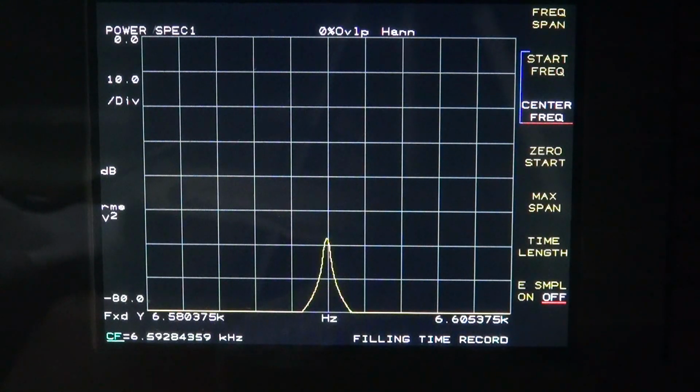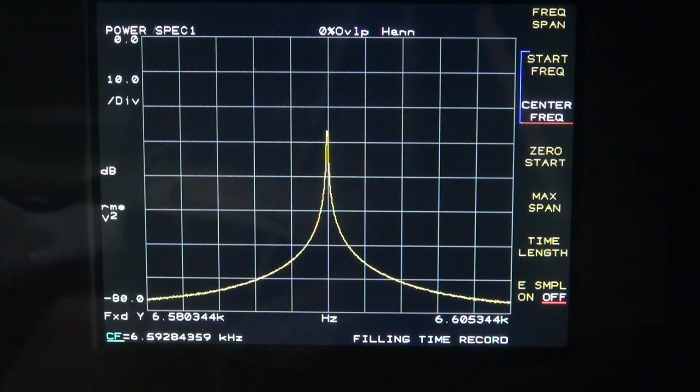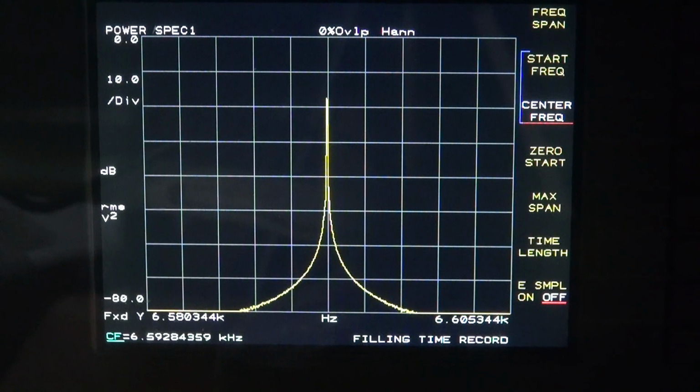So you've got to remember, the oscillator that feeds this coil is a little transmitter. So to have proper frequency stabilization, they're using a crystal, and all crystals have a tolerance. And that's what we're seeing here. This little bit of frequency difference will have no effect on your metal detecting. It's still in the range, and she'll still work great, as all the old vintage Whites did.